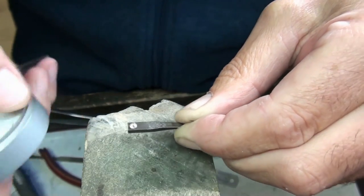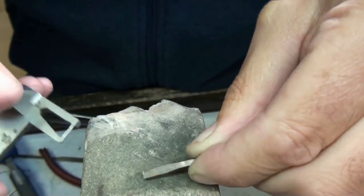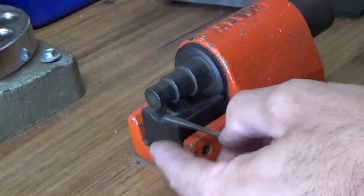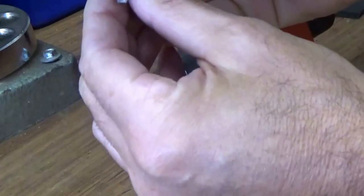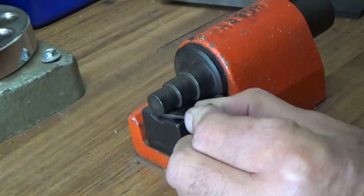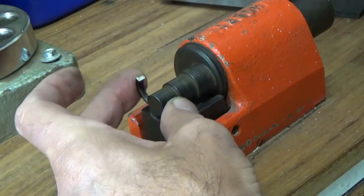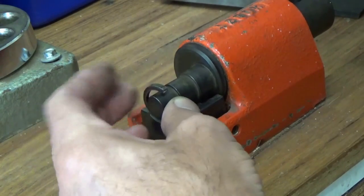I'll form this into the ring now. I just want to show you where the diamond sits on the shoulder — you can see there's metal either side of the stone. The width I've got here is 4.2mm. So with my ring band I just bend up the two ends, and now I'll just work on getting the ends closer together. They're not going to mate because there's going to be a big setting going inside there.